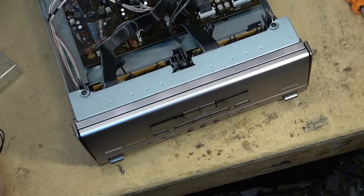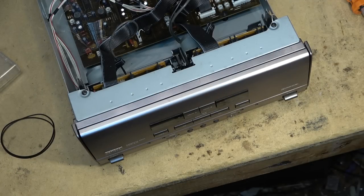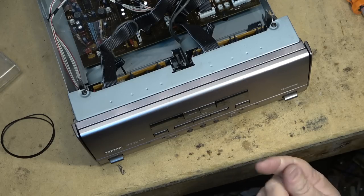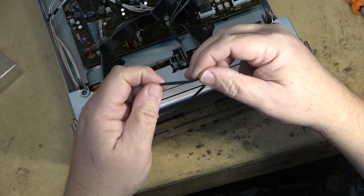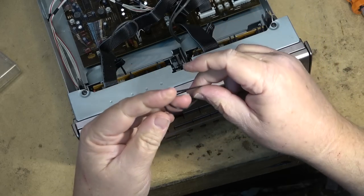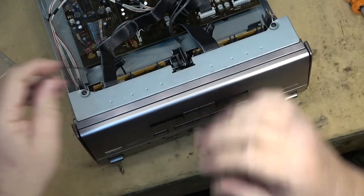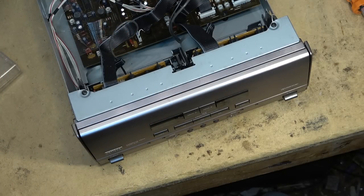The other two belts are still holding up for driving the reel tables — it was just the capstan belts that were slipping. We'll just leave it at those two at this point. For those that ask why I didn't change the other two belts — I didn't have ones close enough to fit, but the ones that are on there aren't turning to mush like the other ones, they've just lost a little bit of their elasticity. These two old belts I'll probably throw in the microwave and boil them for a bit and see if the elasticity comes back, because this is generally the type that do recover when they've just lost a bit of elasticity. Anyway, thanks for watching — we'll catch you in the next one.